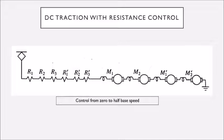When the train is in starting position, the speed is zero. When speed is zero, we need maximum torque to make it operate. As we need maximum torque, the motor actually needs maximum current from the supply — that is called initial inrush current. To overcome this very heavy inrush current, because when heavy current passes through the armature resistance the armature coil has a chance to burn out, we connect external resistances shown as R1 to R3 dash.